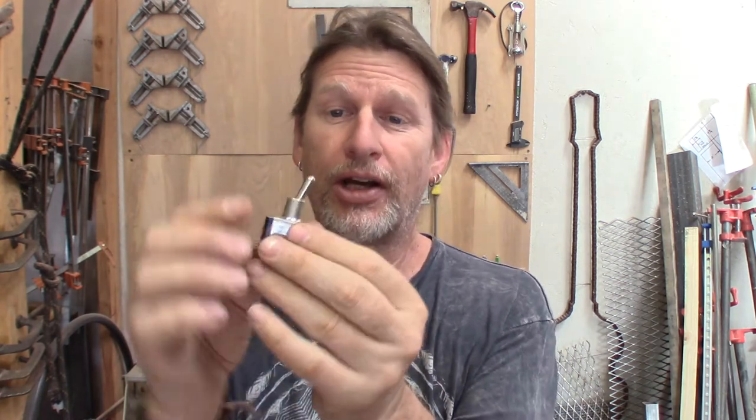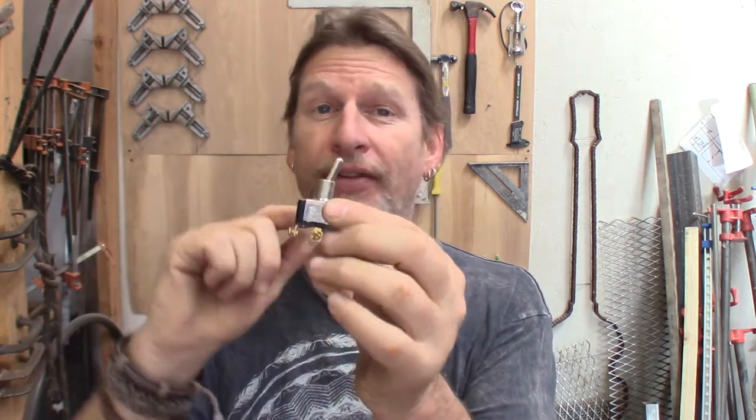Now, I'm big on recycling and reusing products if I can. Now, I went to Goodwill and I picked up an old lamp and I took the electrical cord off of that. I think it cost me maybe a couple of bucks. So go to Goodwill, reuse, recycle. You also want to pick yourself up a little toggle switch. All right, this is just an on and an off. Pretty simple, two connections. That way you have one for your hot and for your neutral.